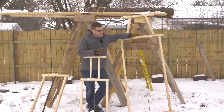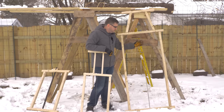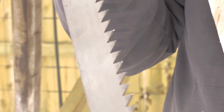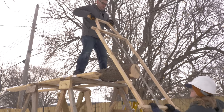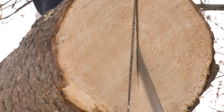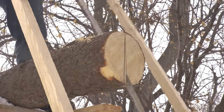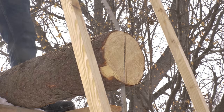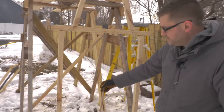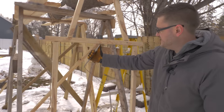Back at it for day two of the milling, hopefully with a little better success. I went through and made a few improvements to the saw blade — basically doubled the size of the teeth, cut out every other one, and added better kerfing to allow a slightly wider cut so the blade shouldn't bind. Also thinned down the blade, but the downside is it bent when pressure was applied after falling out of the frame — a pin came out and it got squished. Just have to straighten it out, get it back in the frame, and tighten things up again.